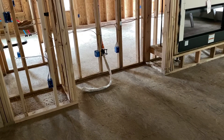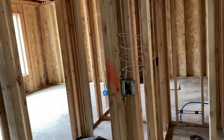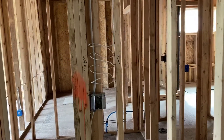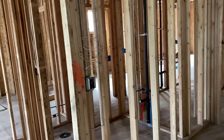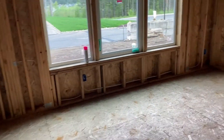For Autonomics or any of the streaming players we use. Another thing we do on these homes is run a secondary 16-2 wire — wire is relatively cheap — for the 2 GIG or Qolsys alarm systems we install. That way, if someone comes through the front door, we can put a panel here or a secondary panel.